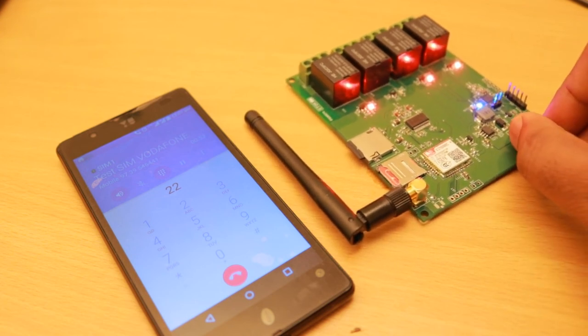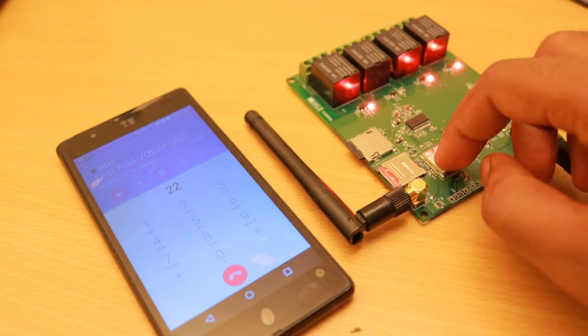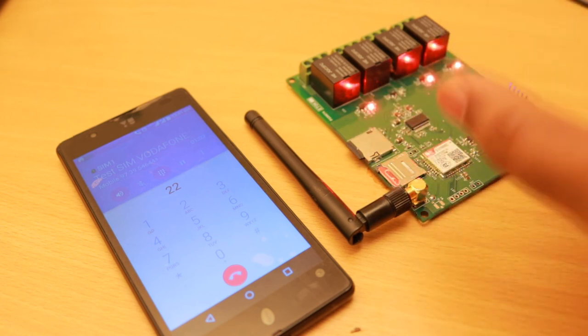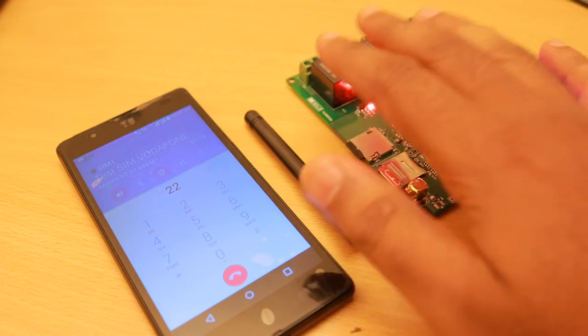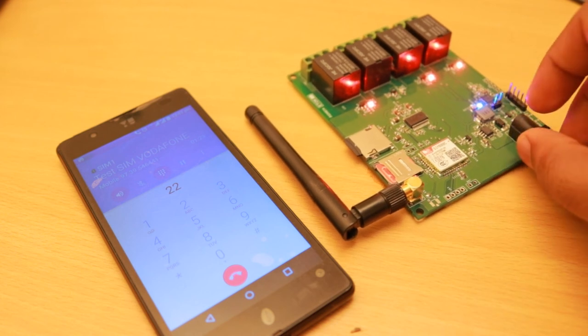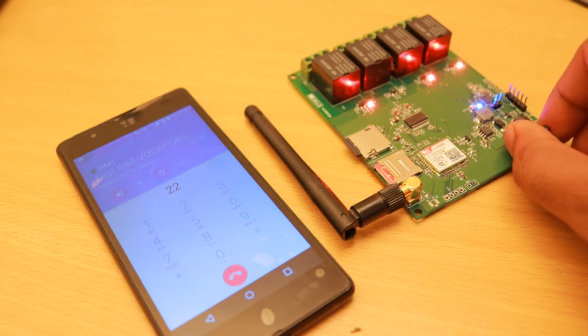And we are also working on adding MQTT connectivity to the board, and the device will be connected to a particular topic and subscribed to it, and you can publish a message or a command to that topic and the device will receive the command and control the relay based on the published message. And of course, we need to develop an Android application or something for this, but for the DTMF portion, you don't need to have anything. You can directly control the relays.